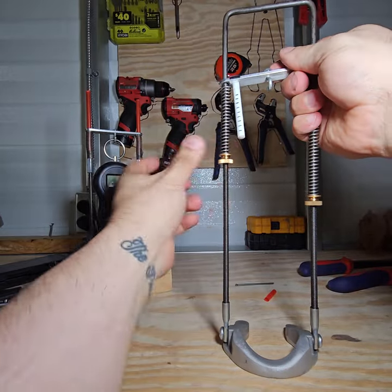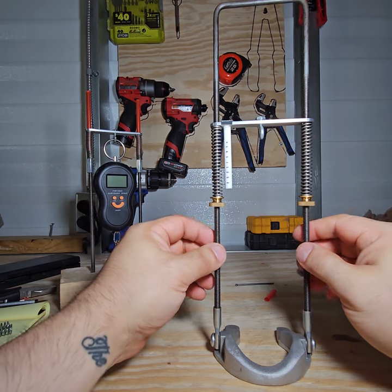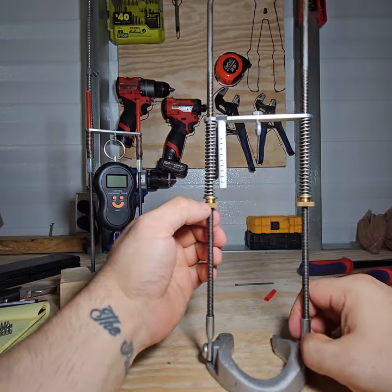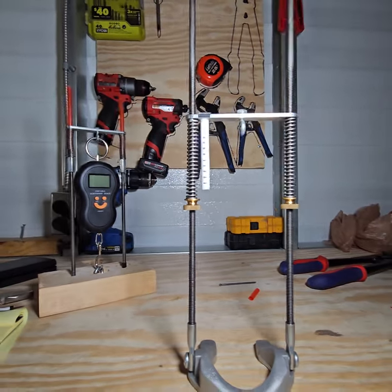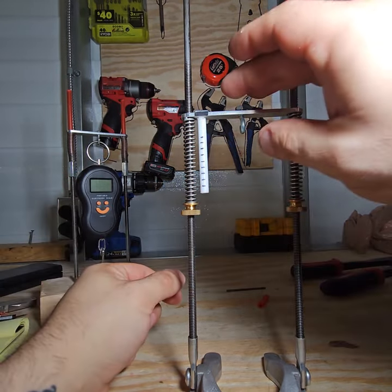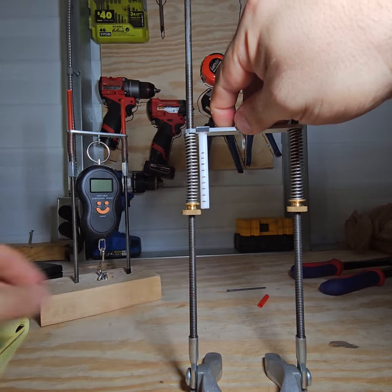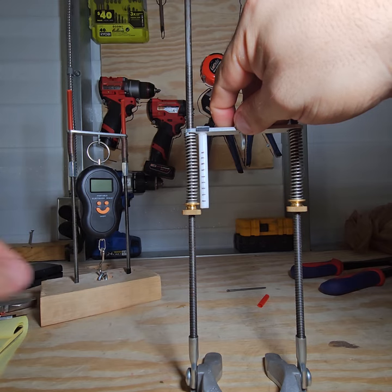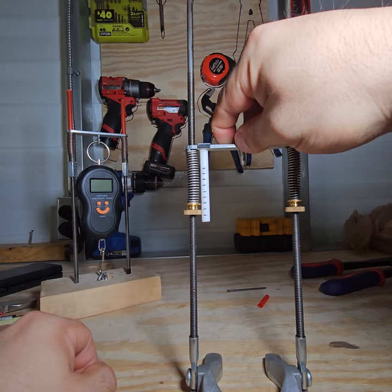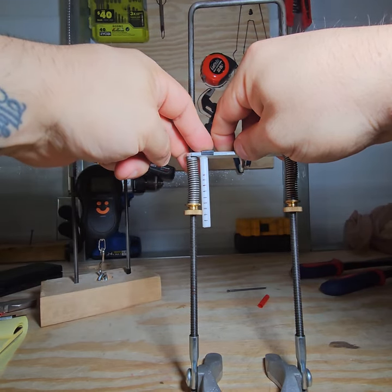This is a 3D printed version — we're actually looking at producing these this week. It was supposed to be a secret but a couple of things forced my hand. This is going to be how we measure tension from here on out. This little clip-on piece just clips on right beside the spring. As you compress, you'll see the markers pass by. The first marker is at 63 millimeters — that's 3 pounds. A few more millimeters is 5 pounds, a few more is 7 pounds, a few more is 10 pounds.